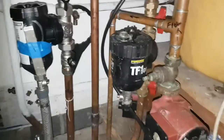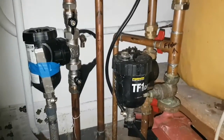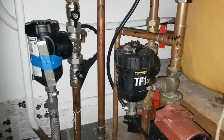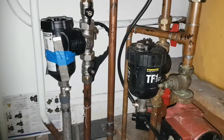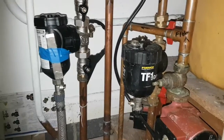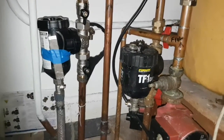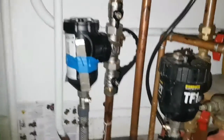The answer is yes, it does. The TF1 still catches lots of large particles, up to perhaps five or six millimetres — rod-like particles, a bit like sawn-off bits of pencil perhaps. The Sentinel Vortex 300 catches lots of smaller particles but it did seem to miss an awful lot of stuff that was then picked up in the TF1.